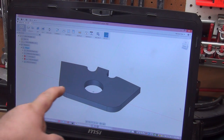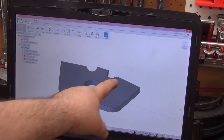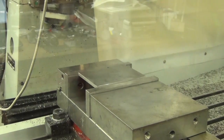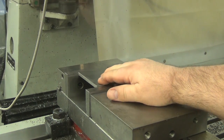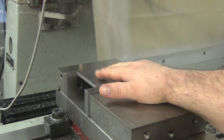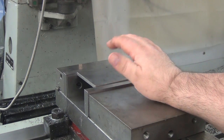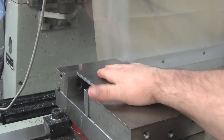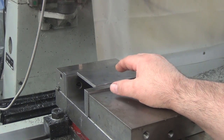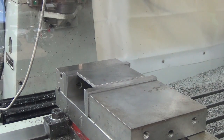This is the tension control rod mount for the ball joint mod. It'll get bent in a couple of spots. Looking to get it milled out. One thing I did was wire wheel off the mill scale — mill scale is extremely hard, and I wonder if that's what toasted my bits on the last couple of calibration tests, because it took a couple seconds just to cut through it and that may have been dulling them. We'll find out.